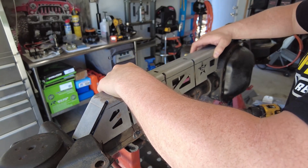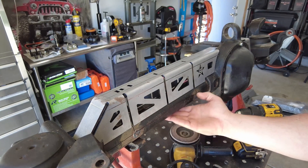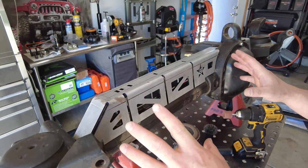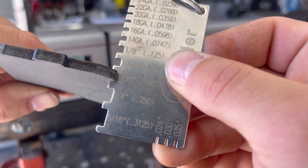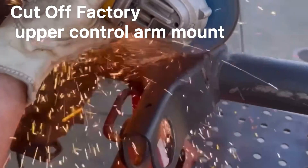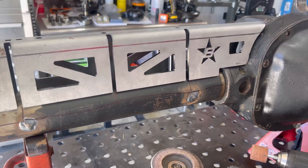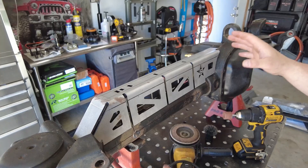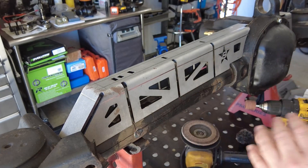This is the Barnes four-wheel-drive axle truss for the high pinion Dana 30, also selectable for the low pinion 30, the Dana 44, and the 60 — all very similar in design. Heavy duty 3/16 material thicknesses for the truss and all the parts in the kit, and the upper control arm bushing which replaces the factory control arm mount is quarter inch in thickness. I really like the laser-cut design — everything's been bent on a press brake and this thing is going to be super strong.